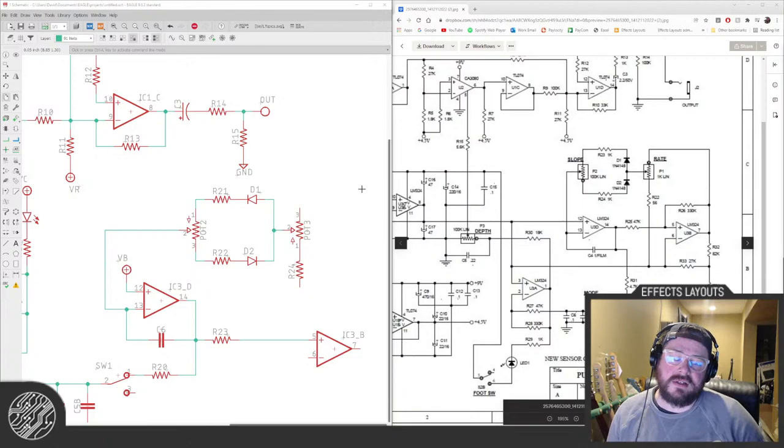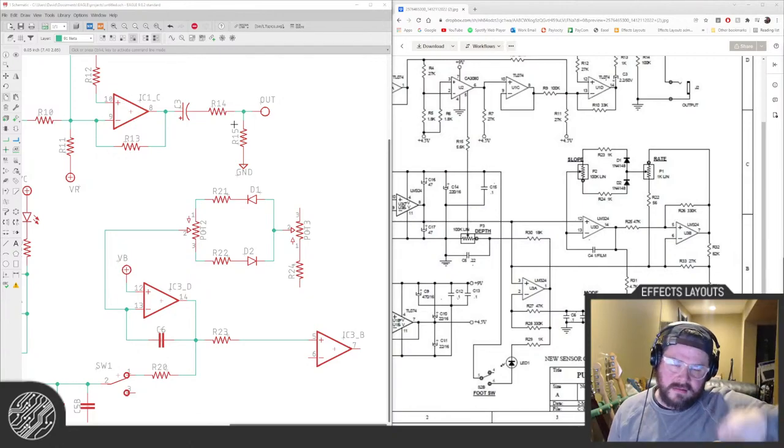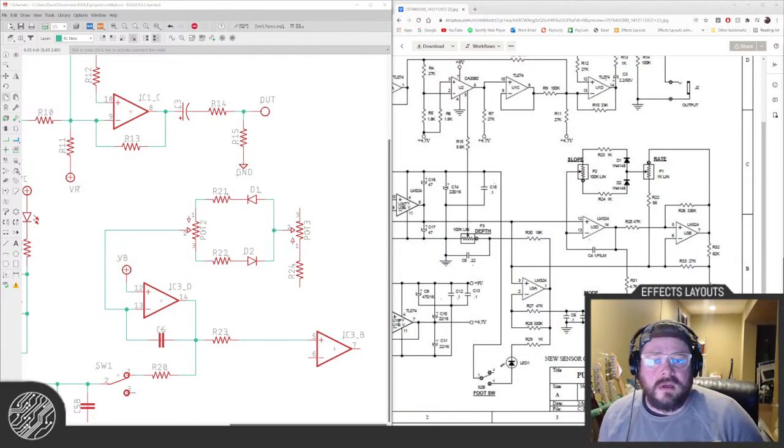One way, if you're etching circuit boards yourself, you can always, instead of etching an enclosure, I basically just did the toner transfer onto the aluminum. I think I even did it onto a powder coated one, which had mixed results. Sometimes it worked. Sometimes the powder coat wasn't as strong. But that worked. I printed it out inverted, and then ironed it on. It looked pretty cool. So that's worth a shot if you just want basic labeling.